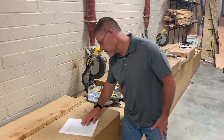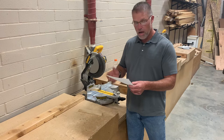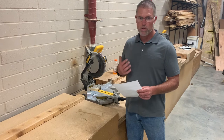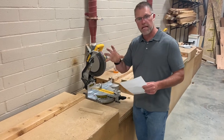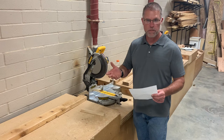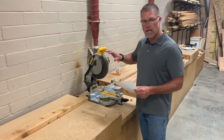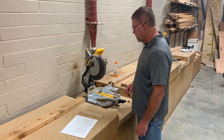Let me look at my list here real quick. Shortest piece of wood you should cut on the miter saw: six inches. We're only going to cross cut. Operate the miter saw with the right hand. Keep the handle down until the blade stops. We can cut plastic PVC pipe — in my engineering class we use a lot of PVC pipe, so we do cut it on the miter saw. When you do that, you cut it slow; sometimes it'll grab the plastic pipe and tear it, but if you go slow it'll do a nice job. In a construction class you're probably not cutting much PVC pipe, but in engineering class we do that and it works well if you go slow. Metal is not going to be cut on a miter saw — don't confuse this with a cut-off saw, which has an abrasive blade on it. There's no metal being cut on this saw.